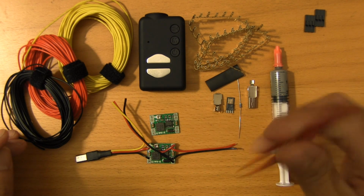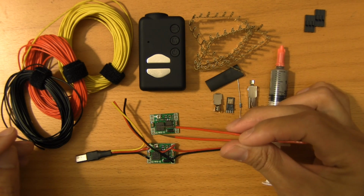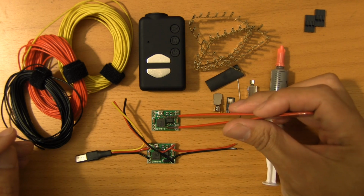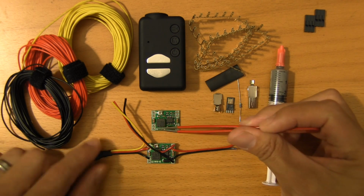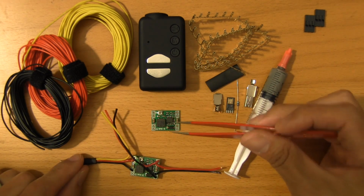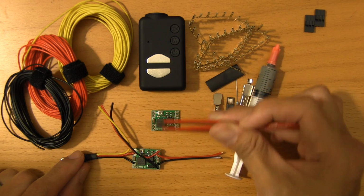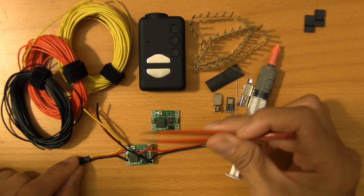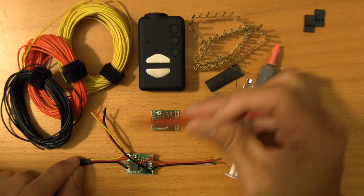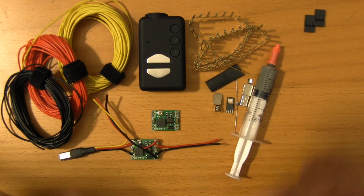Plus, this particular package has 2 inputs as well as 2 outputs. So from this one step-down converter, you could feed a video transmitter as well as your 12-volt camera. Unfortunately, after you step down the voltage, you only get 1 voltage, so you'll have to run 2 12s or 2 5s, but not a 12 volt and a 5 volt, like a 12 volt VTX as well as a 5 volt camera.